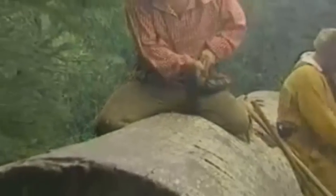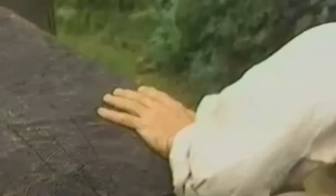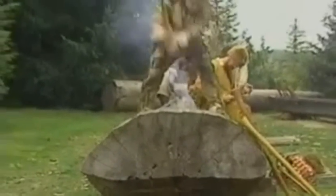The Lewis and Clark expedition used dugout canoes to travel from the Clearwater River down the Columbia River to the Pacific Ocean. They learned to build these canoes from the friendly Nez Perce Indians. The dugout method was a labor-saving way to make a canoe. The tools needed were simple: axes, adzes, broad axes, and saws — all of which the explorers had with them. Once the tree was felled, the log was squared and the ends trimmed, then the bottom was smoothed and rounded with adzes and axes.